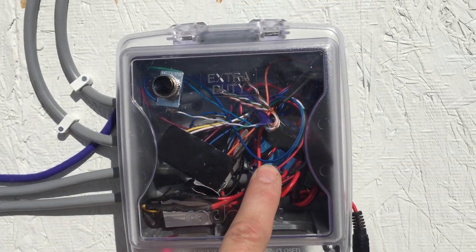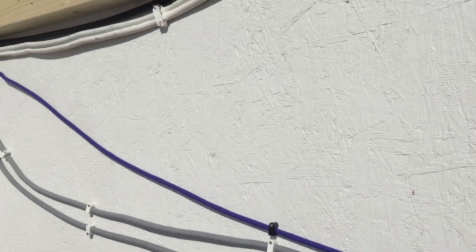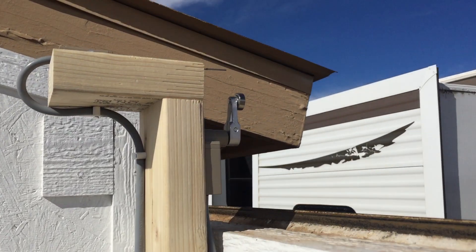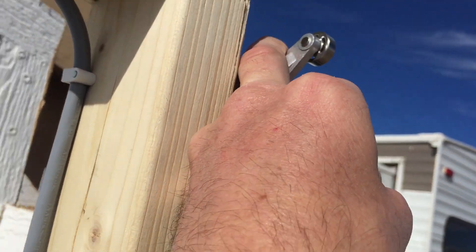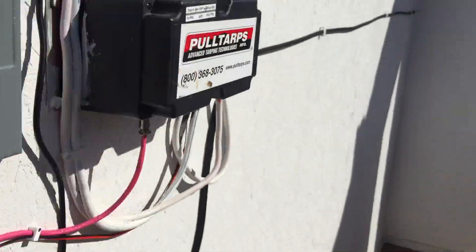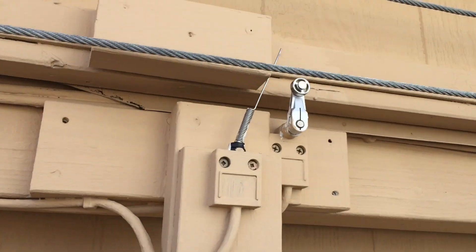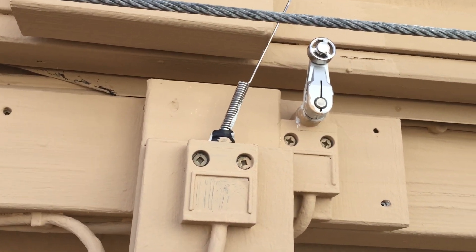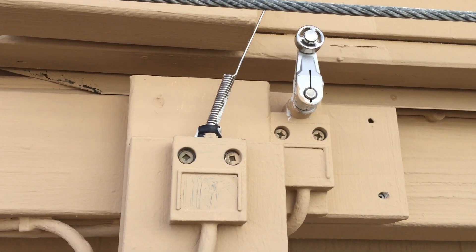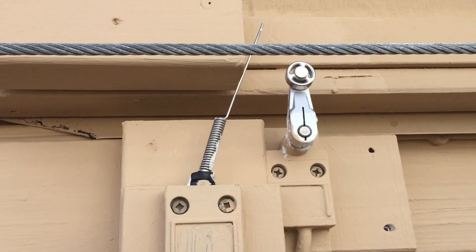The two relays go to the open and close switch. We've also got two toggle switches from Amazon, about 20 bucks each. The first one is a hard cutoff switch. The hard cutoff switches for open and close are wired in-line with the actual open and close button. So if the Arduino locks up during open and anything happens, it opens the switch and completely kills power.